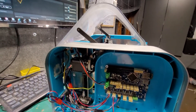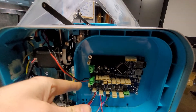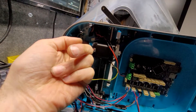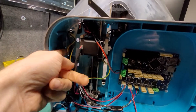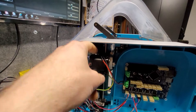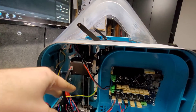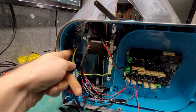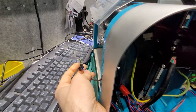The first obvious thing you need to do is wire up the mains. With everything stripped out of the Robox — extruders gone, motherboard gone, all the bracketry gone — you tend to be left with the 240-volt feed and earth cables. On this one I'm going to put a BL Touch on it rather than use the rocking motion for Z bed height probing. The mains wiring is done — a bit of a rough job but at least it is insulated and heat-shrunk underneath.